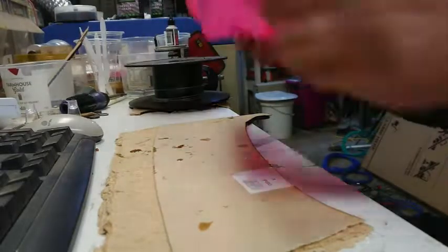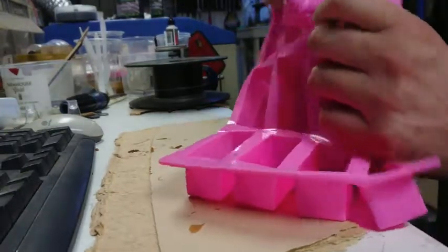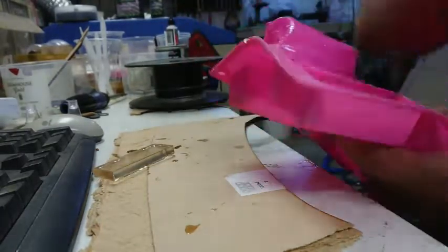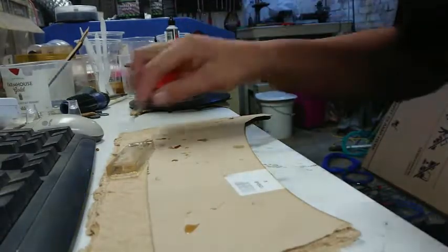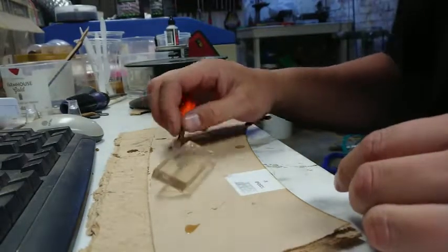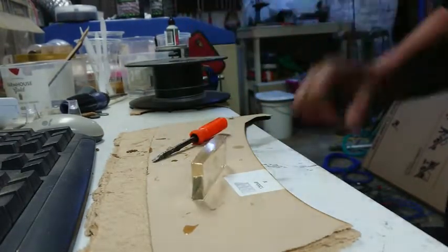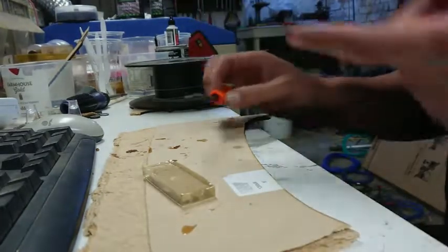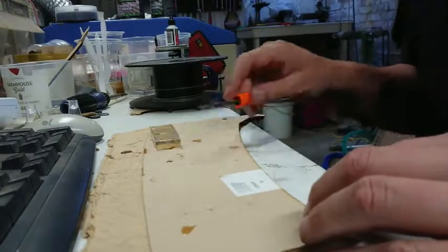What was left from my underwater camera video: in that video I used some excess resin and cast it into a silicon chocolate mold. If you're ever doing polyester resin, these molds are really magic — I got it for about four bucks. This is still a little sticky because the ratio wasn't ideal, but a little bit of heat will fix that up and solidify it. It gives a very good finish straight out of the mold, which is quite exciting.